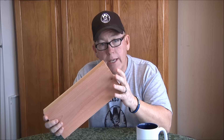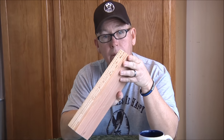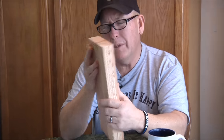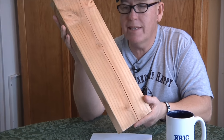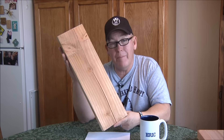The headaches and problems that come from literally not being able to pick the board yourself — let me give you another example. Here's a piece of redwood, a one-inch redwood, beautiful board, hardly any moisture in it at all. But even with this you've got a little bit of a bad edge you'll have to deal with. And here's another board — from a picture it may look just fine, but this thing weighs like 20 pounds, it's like half water. It's probably doug fir construction material.